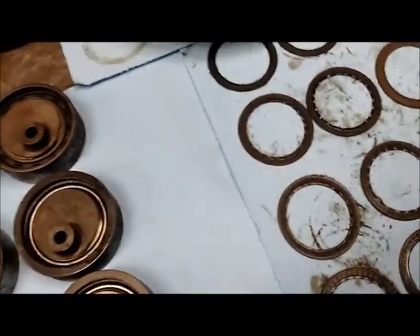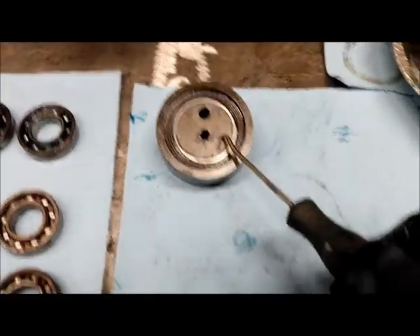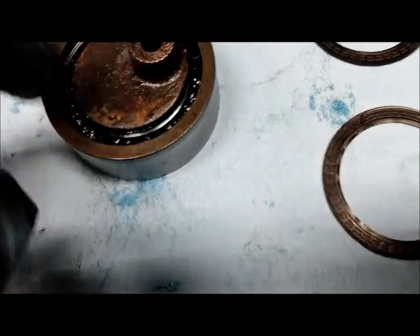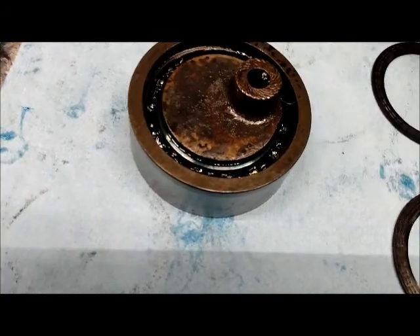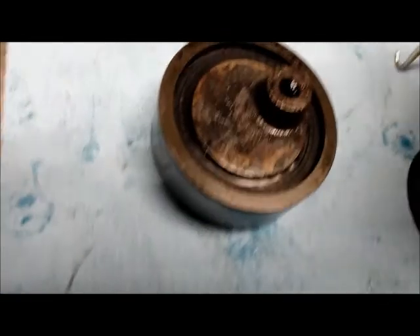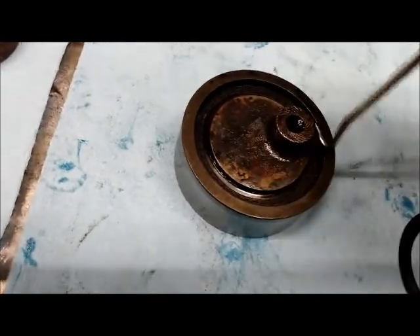All these ones here are cleaned already, so I'm going to start repacking them and putting them back together. Here I've got one done with the seal back in, cleaned up, making sure it's not over-packed with grease. Here's another one I'm going to put together — you can see there's quite a cavity below the shoulder where the seal is going to sit. You don't want that to be too full. Do not touch the inside lip; make sure these are really clean.